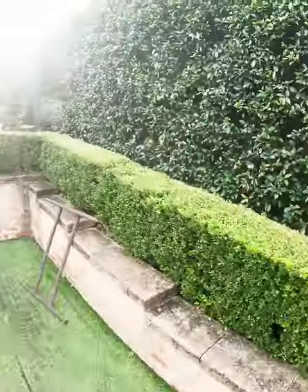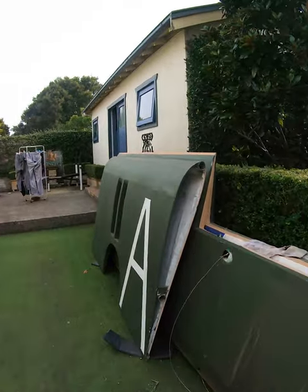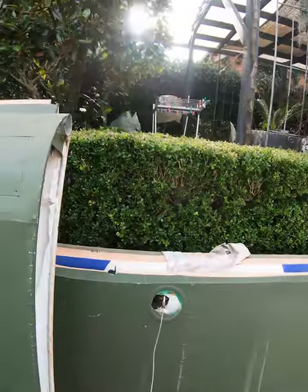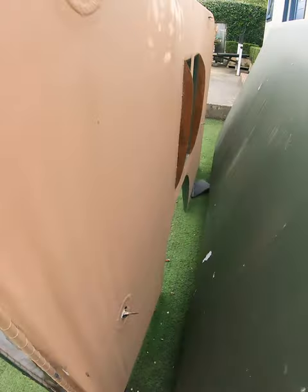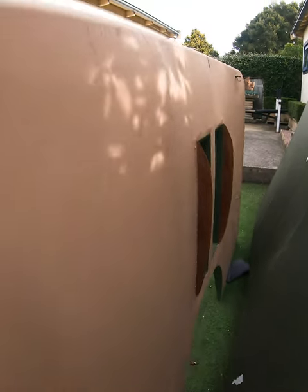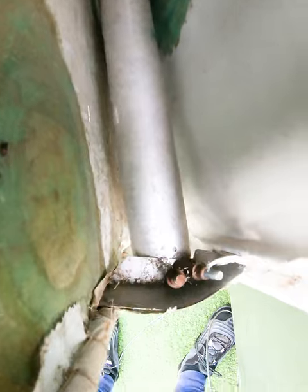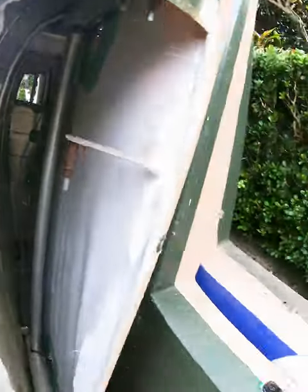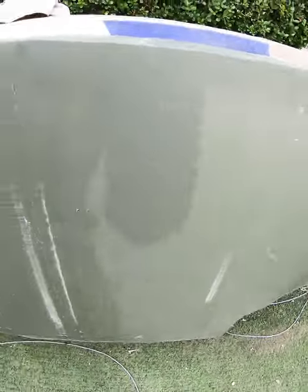At least the fuselage is not covered. Here are the lower wings and center section. After seeing some of the stuff going on with this, I'm not trusting anything, so it's going to be stripped and re-covered. You can see he's stitched the edges here for some reason and it's all just baggy. He's left cleco rivets in the thing, and the swaging on everything is like a clothesline — sharp and nasty bits — so all that's coming off.